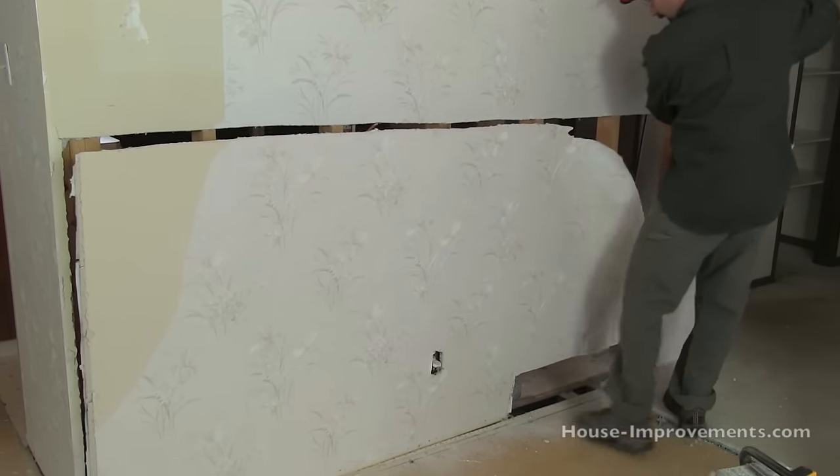It's important to have safety glasses on because as you're pulling away there's dust flying around and pieces of gypsum. If dust bothers you, you may even want to have a dust mask on — even just one of those cotton ones — because there is a little bit of dust in the air. Doing a small wall like this doesn't stir up a lot, but if you're doing a fair bit of demo, there's definitely going to be dust. Once you get this apart, you're going to throw it in the garbage or take it to the landfill, whatever your municipality allows. Hopefully this gave you a little more insight into what you'll find before you start the project and what you could see inside the walls. Thanks for watching and tune in next time.